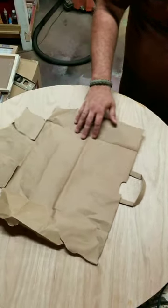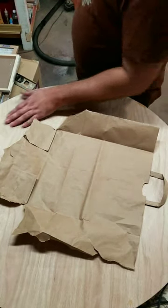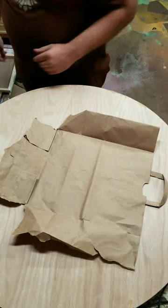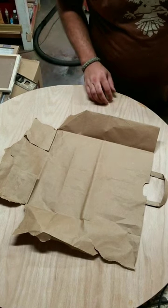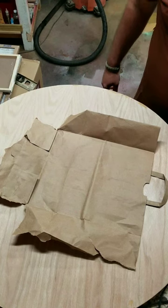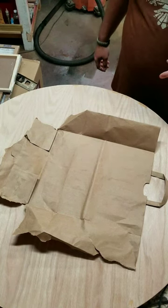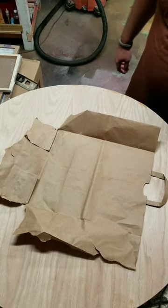So what we've got here is I was using a product from Rockler — the peel and stick veneers — securing everything down. All the other fixtures looked fine, but this one had some bubbling. What we're going to try and do is get that bubbling out using some heat from the iron to reactivate the glue and see if we can get it to stick flat.